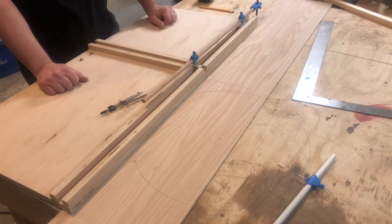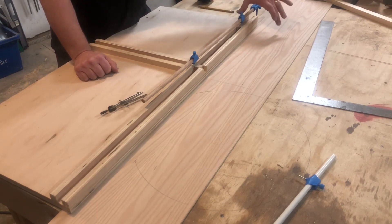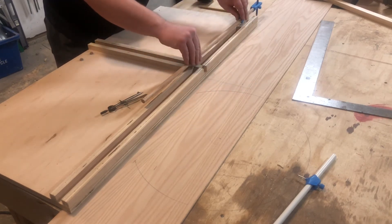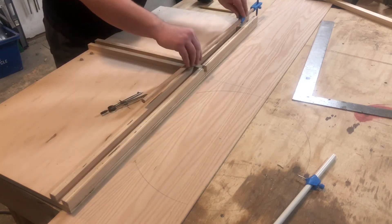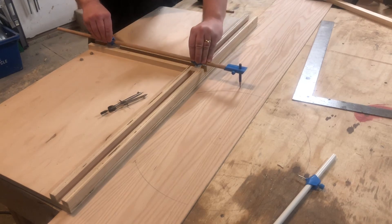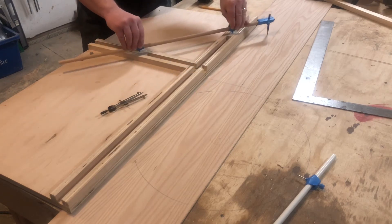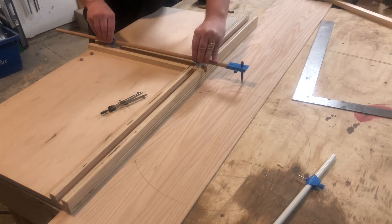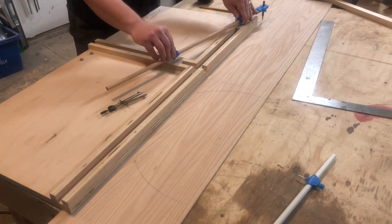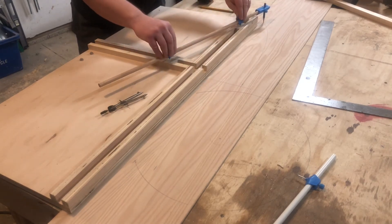Now I'm going to draw this ellipse with two radiuses. It's going to have a nice tight radius here — a six inch radius, or 12 inch diameter circle on the end — and it's going to go back out to a 40 inch diameter this way. You can draw it a couple of times and see it drawing right over the top. This isn't like the string method — this will make the same exact thing every single time. When I push this one over, that one drops down.